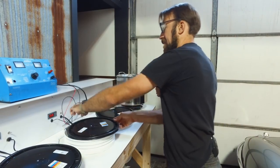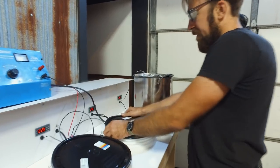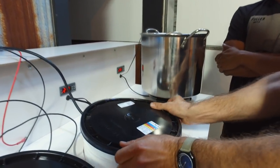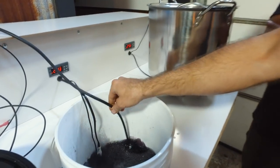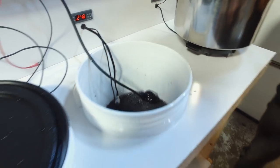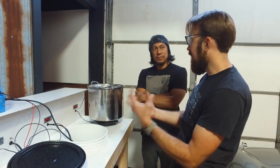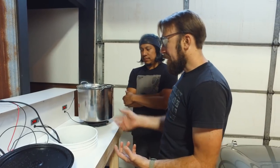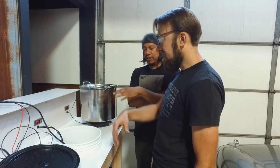Yeah. And then this is the dye. Correct. This is the dye. This is the one you don't want to spill on yourself. And although it shouldn't be done this way, I am doing it this way. We have a second aeration going on in the dye right now, and that's not correct, but I wanted something to circulate it, and I didn't want to have a mechanical impeller. So when I'm actually using the dye, we shut that off so it's not all full of bubbles.